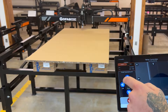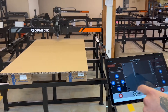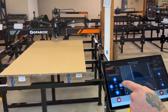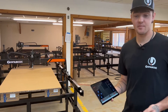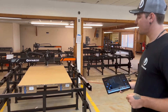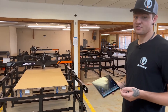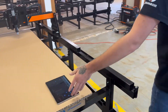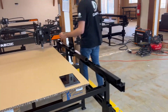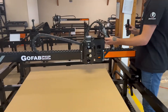The home is not your start point — the start point is wherever you want to be. If I want to start right there, I can start right there. If I want to bring it to the front and start at the front, I can start at the front. All that matters is where you set it. This is a brand new table so I don't want to cut on it, so I'm going to swap it out and put the pen attachment on.